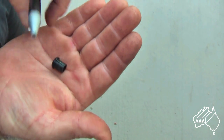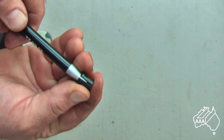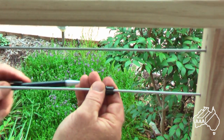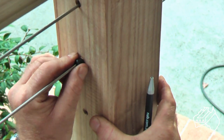If you wish to insert grommets into your intermediate post, you will need a 9mm hole. Open the grommet with a suitable implement — in this case we are using a biro. Hold it to the wire, then remove the biro and slide the grommet along the wire and plug it into the post.